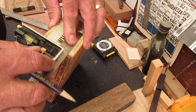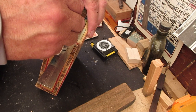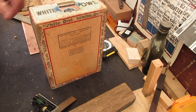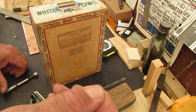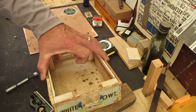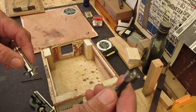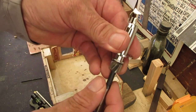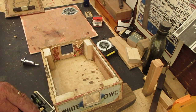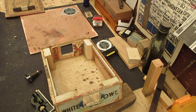So I've got marks at 30 on each side. I can bring my rule down on that mark, eyeball it, and know where I'm going to start drilling. I'm going to take this bit and drill a pilot hole there and there — all the way through. Then, getting into the world of high precision — you see this jack, this Forstner bit matches it just about but is a little smaller. Once we drill the pilot hole, we take this Forstner bit and go all the way through.